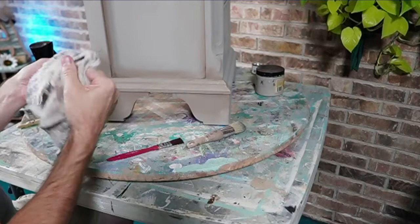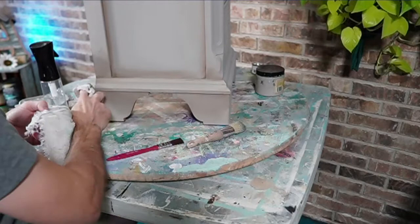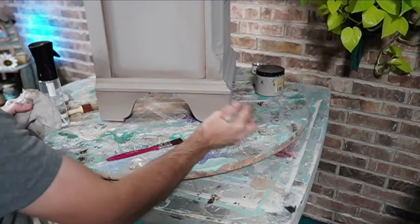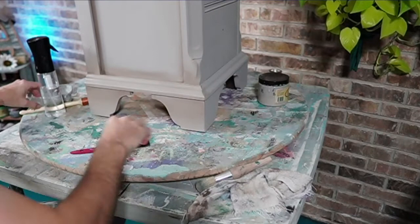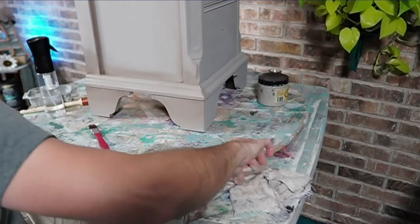Right here I'm going to use my rag and wipe off — just kind of erase some of those areas you don't want it. If you want to do some wet distressing, give it a little bit of extra rub, and with one coat of chalk paint you might actually be wet distressing — and that might be a look you're going for. The nice thing about wet distressing is sometimes you just can't get all the flaws out. I forgot a section — I've got my piece on a swivel and I totally missed getting all the way in there, but it's still a little bit wet, so that works fine.